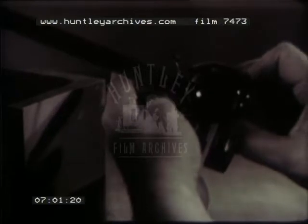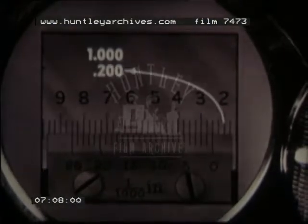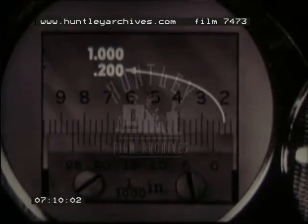The reading is 1.250: 1 inch from the inch graduation, plus 200 thousandths from the 10ths graduations, plus 2 divisions of 25 thousandths each, a total of 1 inch and 250 thousandths.